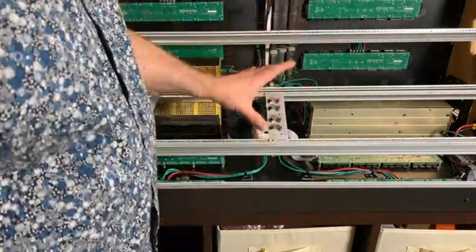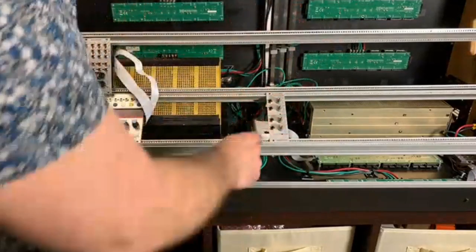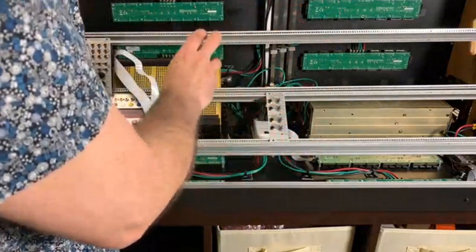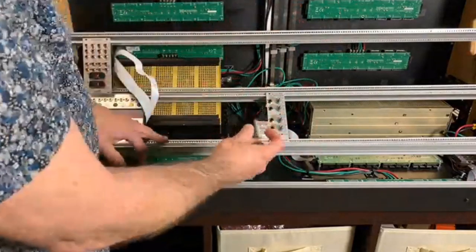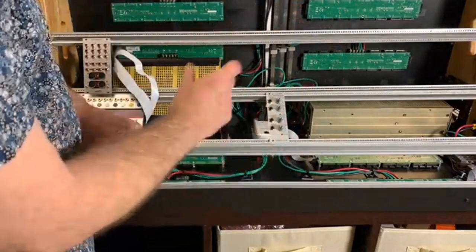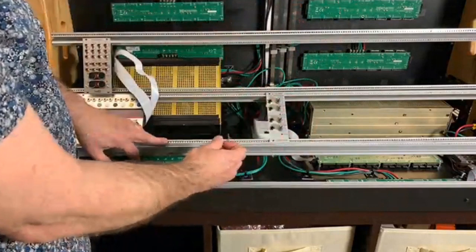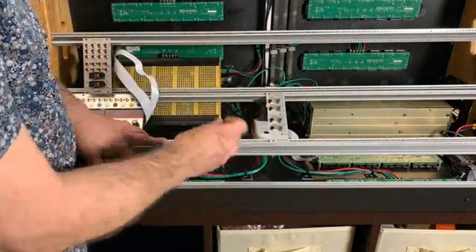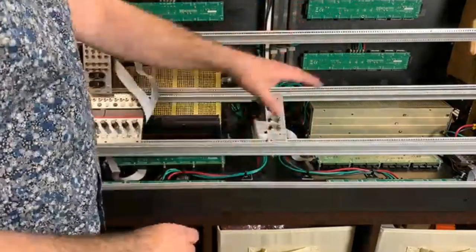But for me, most of the time, I'm turning the delay down to 0, and I'm playing with the length. Setting the length of the gate coming out of something like a Euclidean circles or a grids or an accent trigger allows me to decide how long that pulse is going to be to another module. Maybe I want to fatten the pulse to a low-pass gate to get a little fatter sound out of it. Maybe I have some modules that miss really short triggers. Digital modules that have to scan their input jacks will miss very short gates.